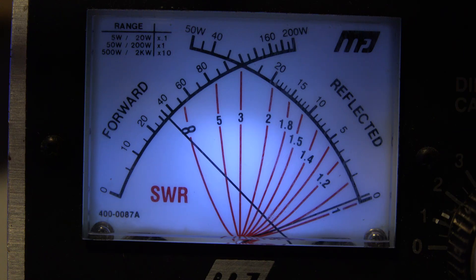My question to everybody: if you have the same radio — either the TS-590S or even the SG — please leave a comment about your experience and how much power it puts out. I don't mean what you see on the radio's own meter, since that bounces around too quickly. Right now it's only showing about 60 to 70 watts on the radio meter, while the external meter — which I truly believe is much more precise — has a peak hold activated to keep the needle steady. Even whistling into it, I can barely get it that high.